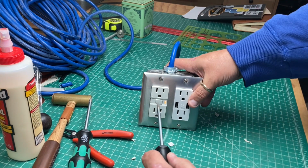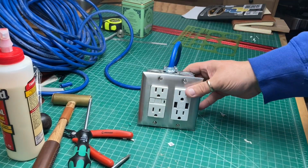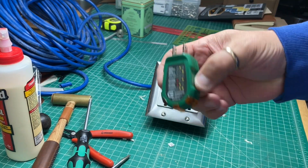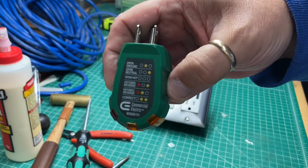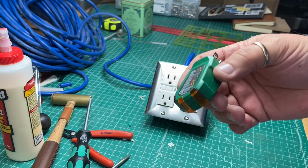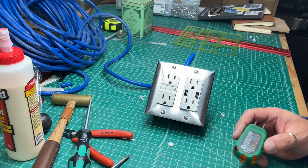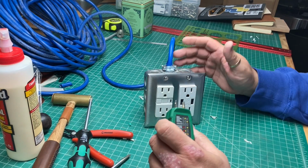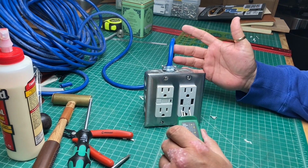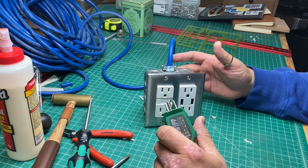Now, you simply reset the GFCI, and now you have power to all your outlets. I got my little tester here. It's got 3 LEDs on it. If you read there, it tells you exactly what's wrong. These things are $10, big box stores. I'll put a link down in the description. Get yourself one. They're super handy. Even if you're not an electrician and don't know what's going on, if you've got a problem with an outlet or something, you can at least tell the electrician you're talking to on the phone what the little readout says and give the guy an idea of what he's working against.